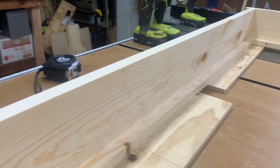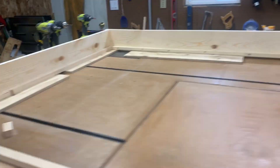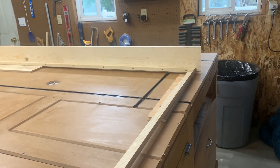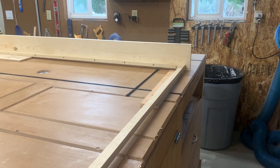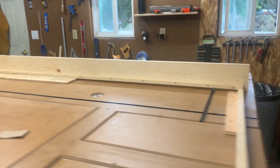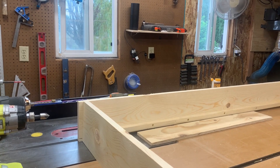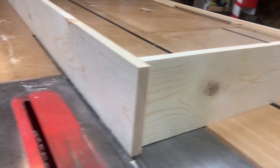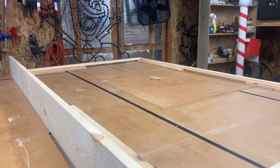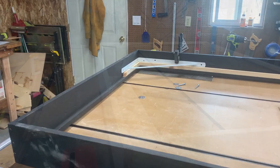I've cut it just to the right size so it comes right to the edge there. I may have to do a little sanding on the opposite end. When I get everything assembled and glued together, I'll sand or cut off the excess for a nice smooth finish. I made the overlap on the top intentionally for weather — so if it rains, the water goes down the side and doesn't penetrate through a gap on the corner.